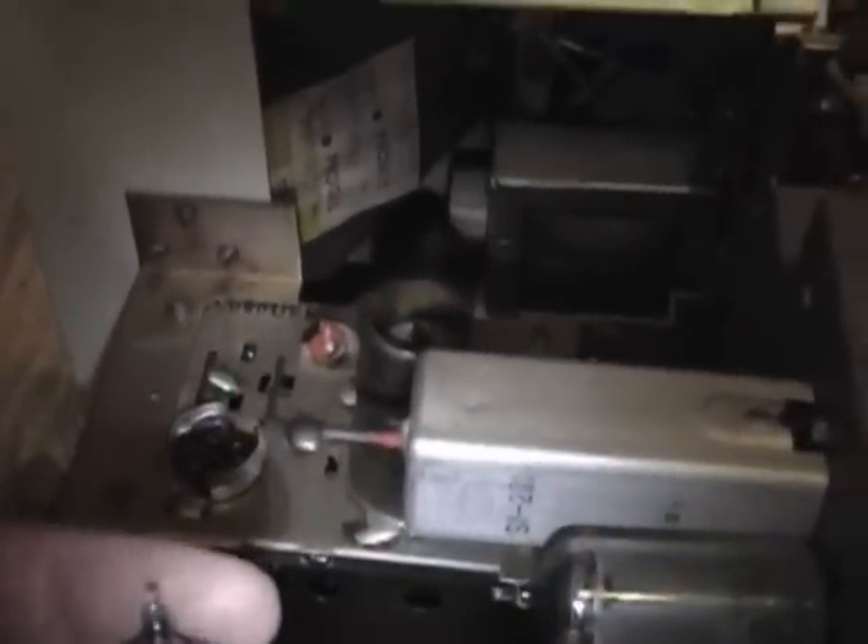The picture tube is a Hitachi — looks like a 210CB4. That might actually be in my Sencore CR70. And I bet that's the date code: 6210 — tenth month of 1962, which is exactly what my guess was: early 60s.